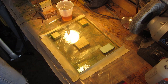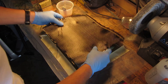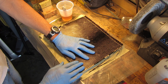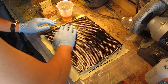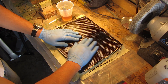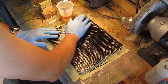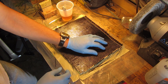Here is the first layer. Instead of cutting a bunch of new layers, I had an awful lot of scrap laying around that I had to use for something. When you make multiple projects, you will inevitably end up with a lot of scrap carbon that you don't have immediate use for. Carbon is expensive — absolutely no reason to just toss it. So I'm going to start with a nice piece of carbon like so. I personally spend probably a bit more time than the average person massaging the resin through. I just prefer that.